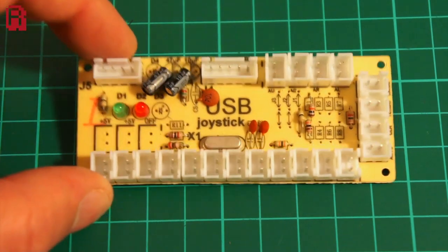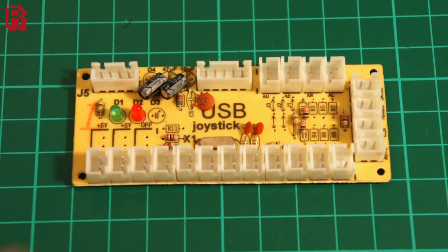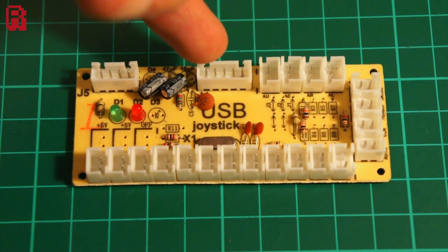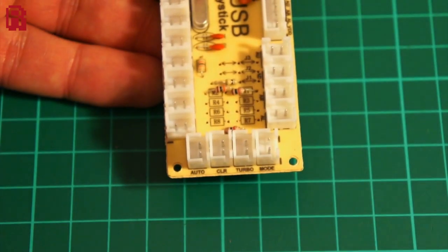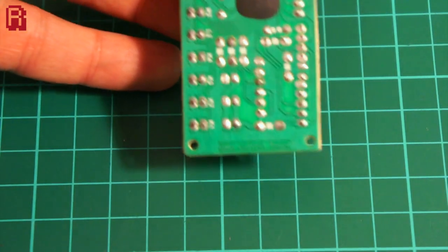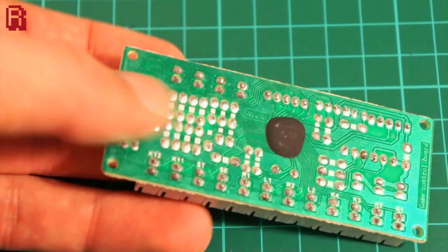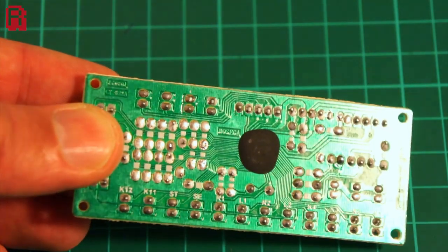By my measurements the board comes in at 8.5 by 3.5cm. On it you'll find inputs for 12 microswitch buttons, the USB cable connector, the Sanwa cable connector, further inputs for the joystick up, down, left and right, and additional inputs to enable auto fire, turbo fire, and joystick input mode. The mode switches between regular joystick input and point of view hat input as detected by Windows. This board is sold under many different names, but you can identify it by the 'Game Control Board' writing on the back, the word 'Sega' written in the middle, or 'CY822A' at the top left, which is the part number.